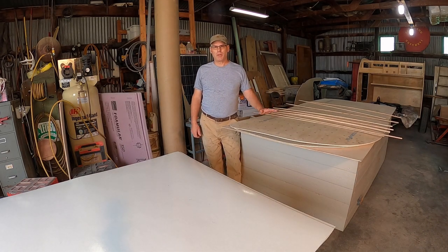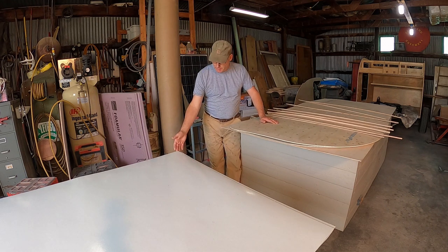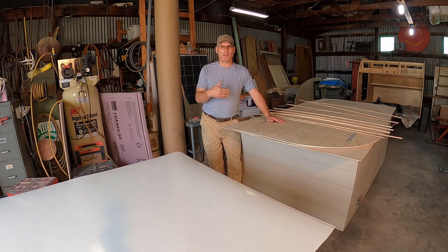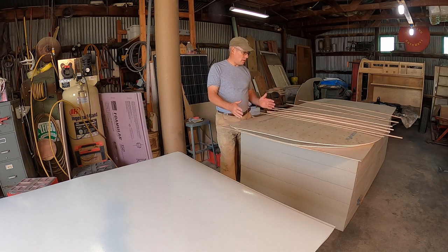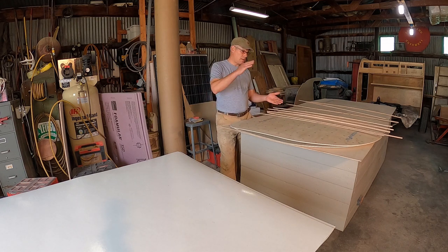We're going to continue with our teardrop build, and today we're going to finally get to maybe getting our Filon attached to plywood. I've been a little apprehensive about this. I've never done Filon, but I've done laminate, like for countertops, and it's basically the same principle. It's a fiberglass product. You add adhesive, a contact cement type adhesive, to both sides, put them together, and they stick.